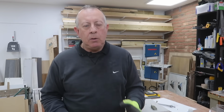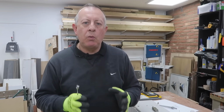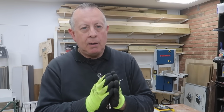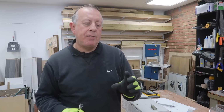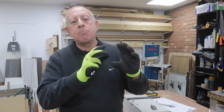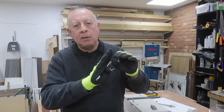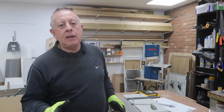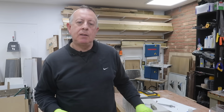Now, one of the challenges with using a material like this is the short amount of working time you've got. Once it's mixed through the nozzle, the instructions say you've got about 9 minutes. I think you've got more like 5 minutes. So by the time you start mixing it, you've got to have all your holes drilled, everything cleaned out, and all your fixings lined up, ready to go. So once you start, there's no stopping you until you complete. But excellent for filling holes that are maybe oversized in brickwork where it's worn away and you really need somehow to re-establish a really good fixing. So something that maybe, if you don't need it now, that you can always think about using in the future.